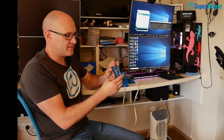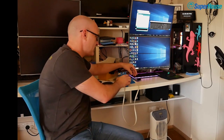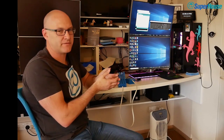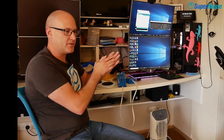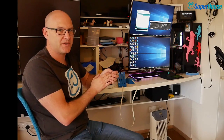There's also going to be a little OLED on here so that we can have different modes. What Chris does at the moment is run a program on the Leonardo which reads from the switches and then sends different events to the computer depending on what mode it's in — for example, a mode for playing certain games, or a mode for Fusion 360 that sends commands relevant to that. The sketch has to be updated on here in order to change the mode. So what we want to do is streamline that process and make it really easy to define your own custom modes, specify what you want the key events to be, and then switch between modes very easily.